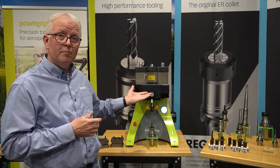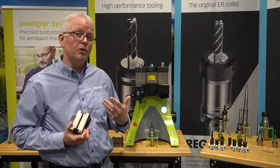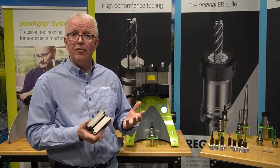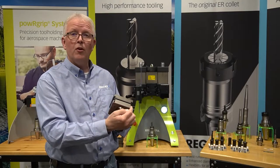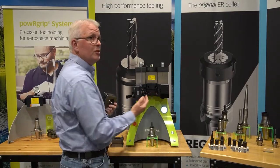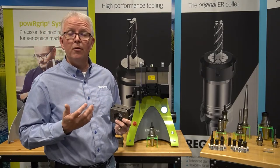So I put it in its bottom position. Now if I simply remove the die I can show you how the machine works and knows what pressure to generate. On the back of each insert there are five different ones from PG-6 through PG-32 — they are pinned. There's a pin depending on where it's at that presses against a series of micro switches in the back of the machine. Those micro switches tell the power grip machine what pressure to generate.